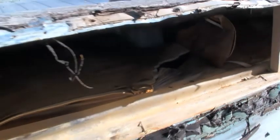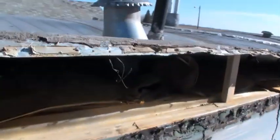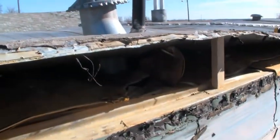In opening up the roof, we can see that we can access that hole around that chimney pipe, so we'll go ahead and put some tin around that to close that up. Sometimes you just got to look for alternative ways. It's just about impossible to get in from the inside. We'll be able to seal this one up from the outside.